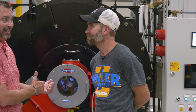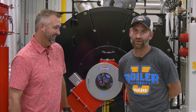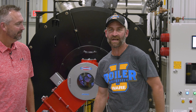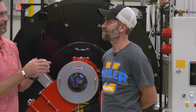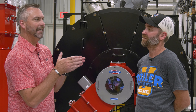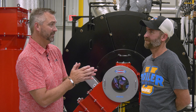This is gas fired, obviously. On an oil-fired burner, is there a different looking flame? On oil, I hope you wouldn't be able to look into it — it should be so bright when you look in there that it blinds you. But it's the same situation on oil: when you're looking at it, it should be bright, it shouldn't be lazy, and there should be no haze in the middle. We do want that flame shooting down the center of the Morrison tube. You can actually see some that may be licking the Morrison tube sometimes.